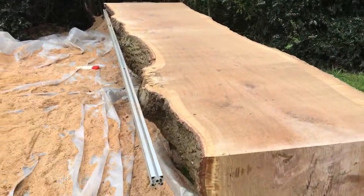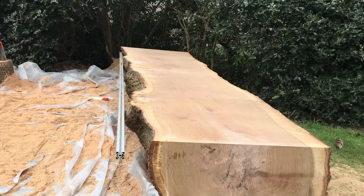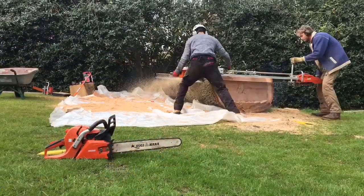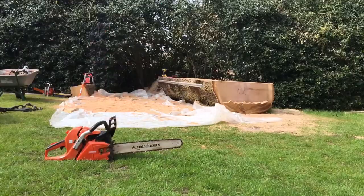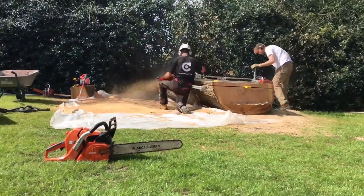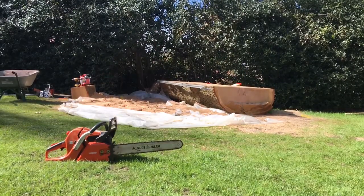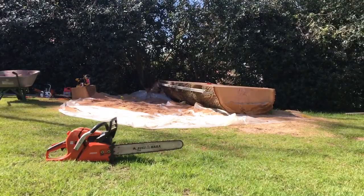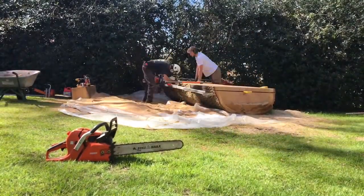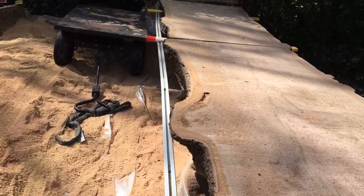So on this one, we've hopefully set up this guide rail so the runners of the mill come up against it, so it doesn't keep trying to surge in towards the log and jamming all the time. Okay, you can see it's still cutting nicely, but the reason we got this rail is because otherwise the saw keeps trying to plunge in, so we need to find a better way of doing this really,